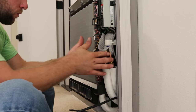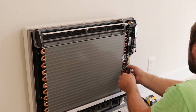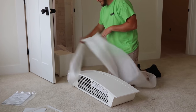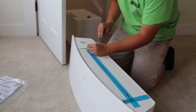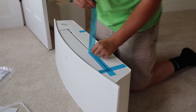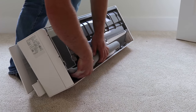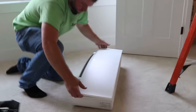This interior unit, or head as it's called, is a floor-mount model and it will be controlling the temperature in our bonus room. We have wall-mount units in each of the other bedrooms, each in their own zone and independently controlled with their own remote control. This is a big part of why ductless mini-split systems are more efficient — it's not a one-size-fits-all solution to temperature in the different spaces in a house.